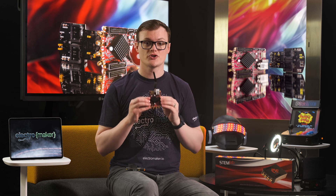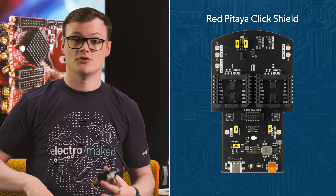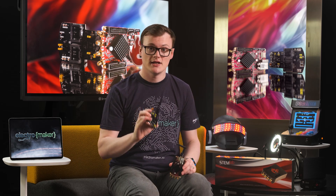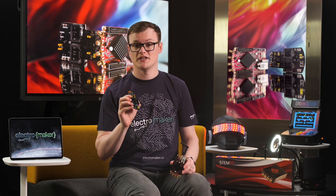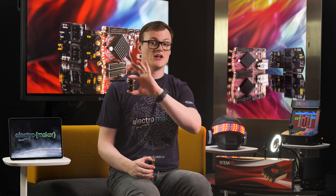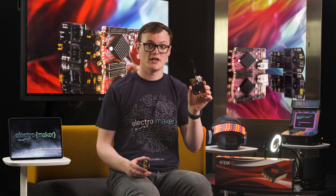Additionally, these GPIO also support UART, I2C, and SPI, which is massively beneficial for peripheral expansion. The Red Pitaya Click provides two microbus connectors, while a whole range of switches and jumpers provide a high degree of configuration, including interrupt sources, triggers, and voltage selection. The addition of tiny coax SMD connectors also allows for low-loss connections between different Red Pitaya boards, allowing for further expansion. And the use of carefully controlled impedances means that you can spread critical signals, such as clock signals and triggers, across various boards, all while ensuring clock synchronization — so you can sync up multiple boards and make sure they're all working correctly with each other.